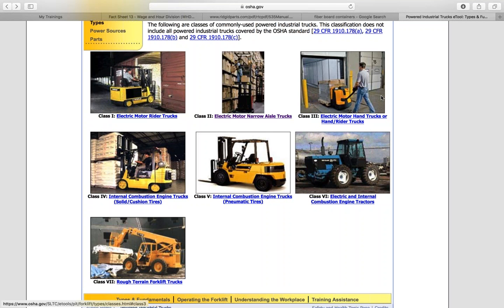And then your jack on the next page. The biggest thing with a jack, I'll tell you, is you got to watch it. We got to respect its weight capacity. The good thing is a lot of these jacks can hold way more weight than what we anticipate. I'll give you an example. Picture like an illustration for figure 13. With jacks like that, those things will hold 8, 12, 15, 20 tons, okay? So, of course, you don't want to put all your trust in one, but obviously, just be careful of it. I tell people if you're using it on any type of a vehicle or anything, either have a second jack or have a fixed jack, right?